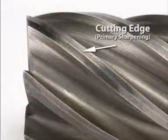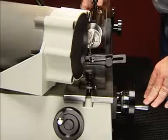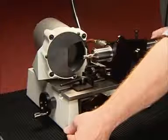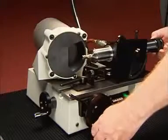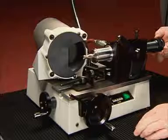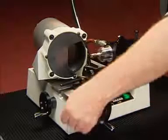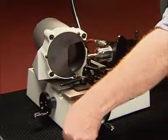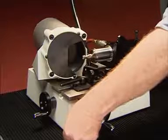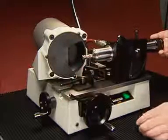Step 2: Sharpen the flutes. Now you are ready to sharpen the primary edges of the flutes. You sharpen the flutes from the shank to the end. Thread the endmill onto the stylus until the shank is as close to the stylus as possible. Turn on the motor and advance the feed knob until the wheel lightly touches the endmill, then advance one to two graduations more. Note that each increment of the feed knob represents two one-thousandths of an inch in movement. Sharpen by slowly pulling the endmill away from the wheel until it comes off the stylus. Push the clearance handle down and thread the next flute on the stylus. Slowly release the clearance handle and again pull the endmill until it comes off the stylus.